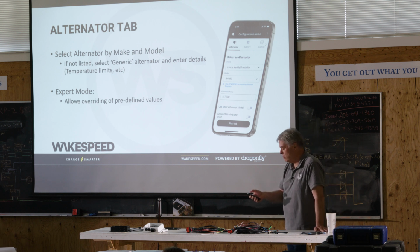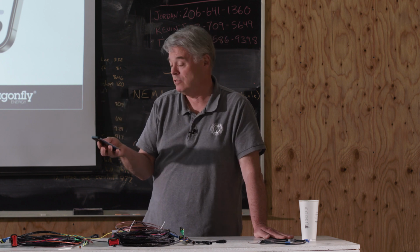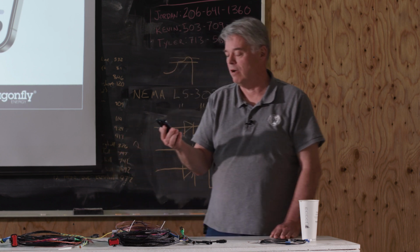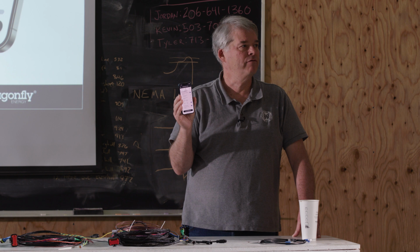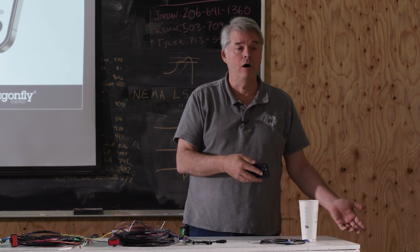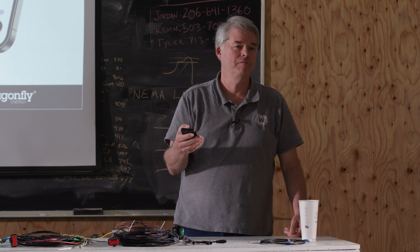Okay? If we go on to the systems, boy, I tell you what, there's a whole bunch of rose-colored stuff in systems. I'm not going to go over every one, but I'll just give a summary. Advanced options. This is some of that reliability stuff. So do you want to require there to be a CAN connected BMS, and if it's not there, what do you want the regulator to do? Do you want it to go into a degraded mode, or do you want it to go into a fault mode? Every one of these has got a default behavior, and you can override it through a hard fault.